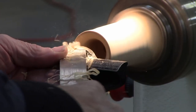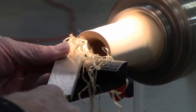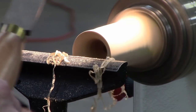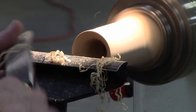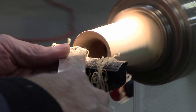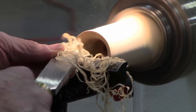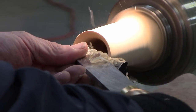You'll go out here on the edge of this thing, because one of the important things about making the bell is you need a very dense piece of wood, and then it needs to be turned very thin so that you get more of a bell action. If it's red oak or poplar or something like that, it just doesn't have the bell-like quality, even though that one there didn't ring very well. But I imagine if you used something like bocote or rosewood, some of those woods they used to make xylophones out of, I'm sure they would ring even nicer than this.